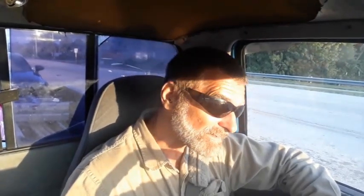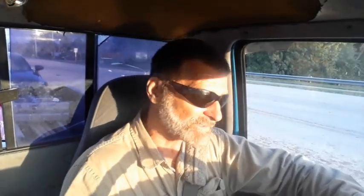So I found the brick, stuck it in the bottom of the box, and I left it in there for about 2 hours, close to 2 hours. Figure let everything stabilize. Then I went back out and timed it again. This time I'm getting the same temperature ranges too. Of course, it's not going to change that. 93.5 it kicks on, 94.4 kicks off, and 95.5 is its end of climb.